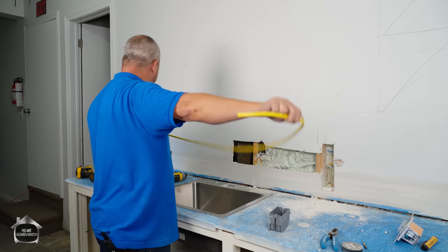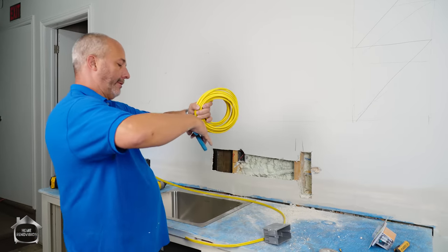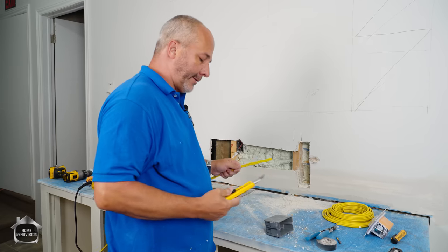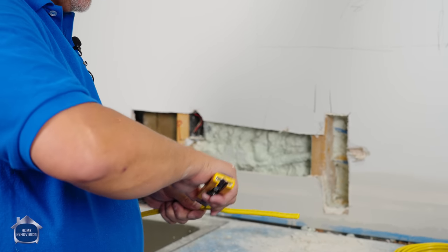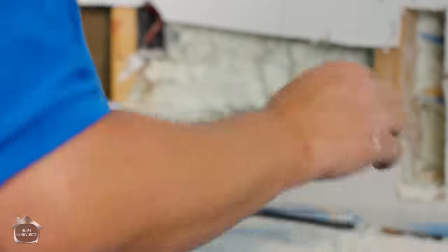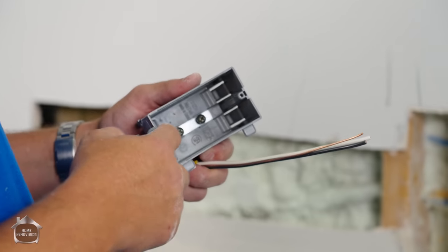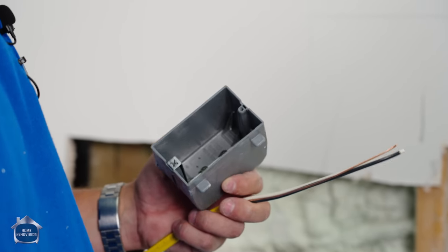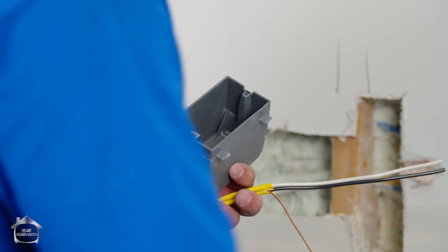So I'm going to get this wire through the wall from one plug to the next, and I want to have about a foot on each end. This is only two wire — it's black and white, but it's a thicker gauge, so it carries more power. That's why you can run two plugs on it. We're going to take about eight inches of this sheathing and run it against the copper lead. On these boxes, this piece of metal connects to the ground screws. So when you're taking your fixture and you screw that with the metal screw, this connects the ground to the plug — you're already grounded. Just to be safe, you can wrap the ground screw and then bring this out and run it over to the green. That's what I like to do.